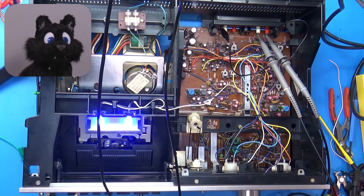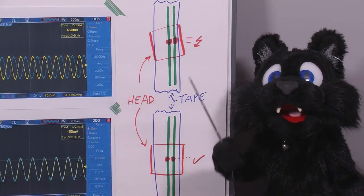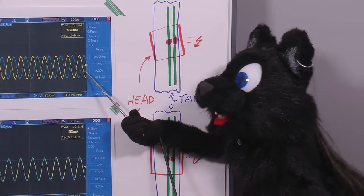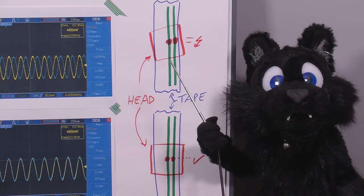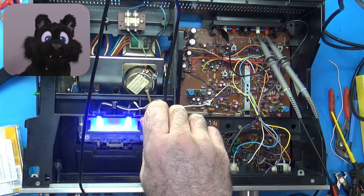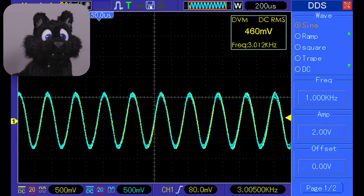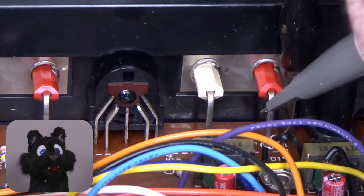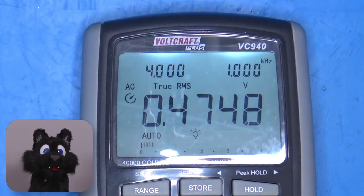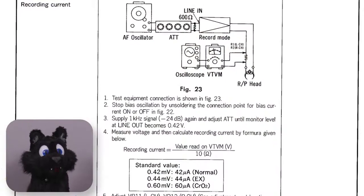All set! Power on! Well, the lights work! And the tape moves! So far, so good! Let's start by adjusting the tracking of the head. I have a 3 kHz reference tape for that. The oscilloscope output on the left and right channel shows nicely when the head is not aligned, as the sine waves are slightly offset. Up next, motor speed — the 3 kHz should also play as 3 kHz. There is an adjustment pot in the motor. This unit also predates quartz-controlled motors. Making sure that the 0 dB reference signal produces the right output voltage on both channels, and that the VU meter shows zero at the same time. Measuring the recording and bias currents — I could do this almost properly since I found the service manual.